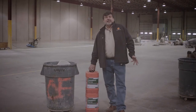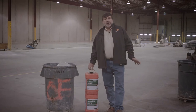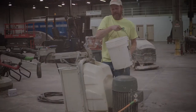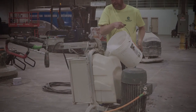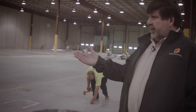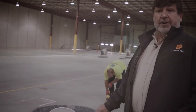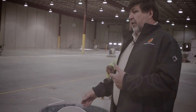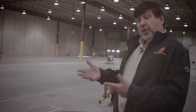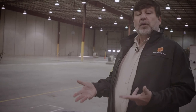It is designed to be used straight. In this particular application, they're pre-mixing it in a barrel and pouring it in the water tank on their grinders. A lot of grinders don't have water tanks, so if you don't have that ability, you want to pre-wet the floor and spray the first cut down undiluted with a pump-up sprayer.